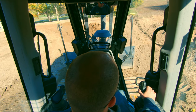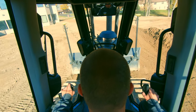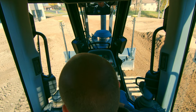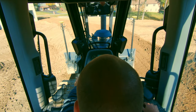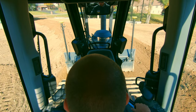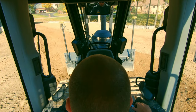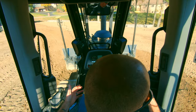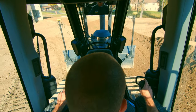You'll notice that the dozer operator's hand is pretty busy. If we just set our blade height and leave it while going forward, here's what happens: I'm cutting on this side, and once my track falls into that cut, the machine starts to lean — which means the blade starts digging more, the machine leans more, and pretty soon we're digging hard on one side and barely touching the ground on the other. That's why the hand is so busy — if you leave the blade alone, you're not going to cut level. The machine follows whatever grade you're cutting.